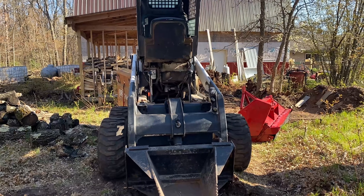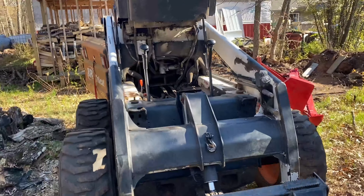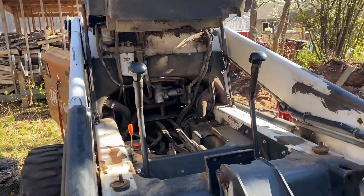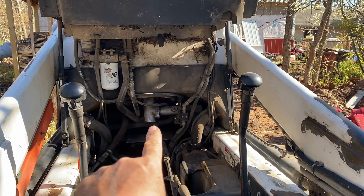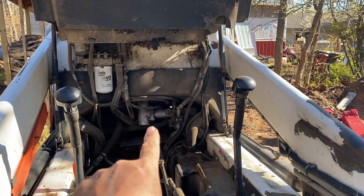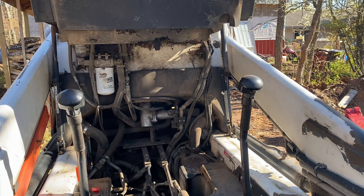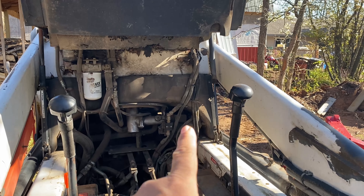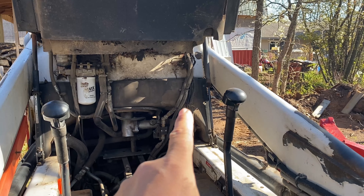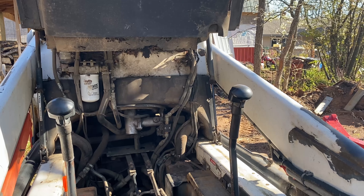So once you get the cab up — I don't know why I've got to always lift the cab for everything on this thing — but you do. You've got to get all the way underneath the seat. If you look right there, you'll see this is the angle gear that runs the blower fan for cooling the engine compartment, and on this side of it there's going to be a pulley. We're going to go check that belt and see if it's broken.